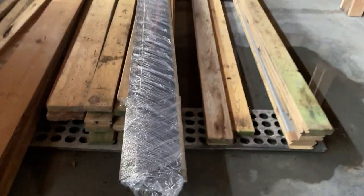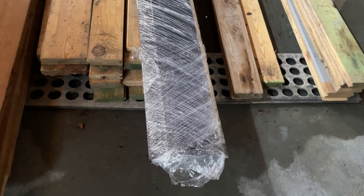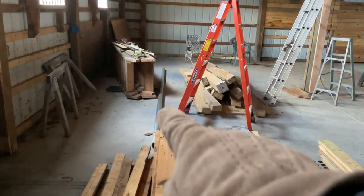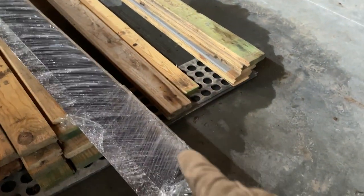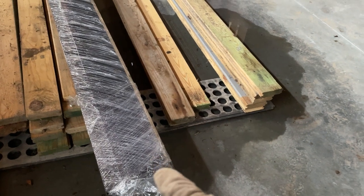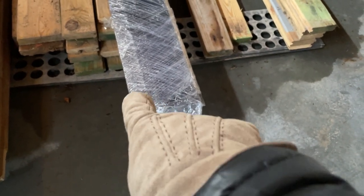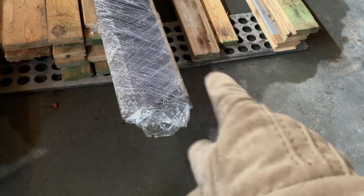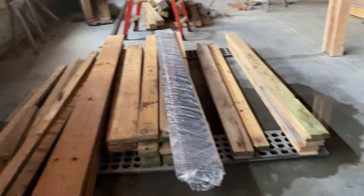There's also a shield piece — it's still wrapped. If you go online and look at YouTube videos or even photos, you'll see that over the top of the rail, once it's mounted up on the board, this shield goes above your — I'm using a two by ten that the rail will hook to. This shield mounts right above that to the framing and then hangs over to protect the rail on top of the door from rain getting in.